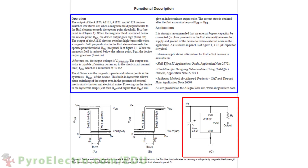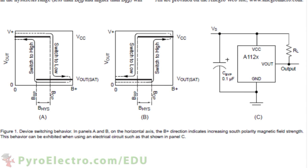The basic operation of this sensor is that if we power up the sensor at plus 5 volts, we should expect a plus 5 volt signal output when little to no magnetic field density is detected. But if the density increases enough, the sensor will turn on, pulling the output to 0 volt ground. With this information, let's build a system that turns an LED on if the sensor detects a magnetic field and off when no magnetic field is detected.